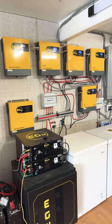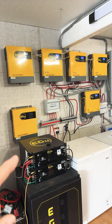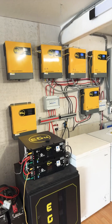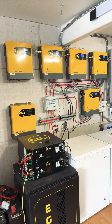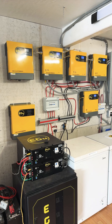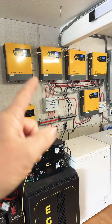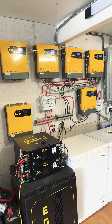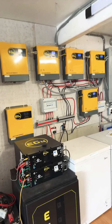That's my personal thought on that. I'm adding two more because I want to be able to run a 12.7-ton electric pool heat pump heater for heating water. It can heat like two to three degrees per hour. It draws about 7,500 to 8,000 watts at 230 volts, so it uses a lot of power.